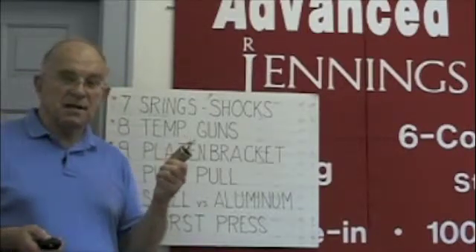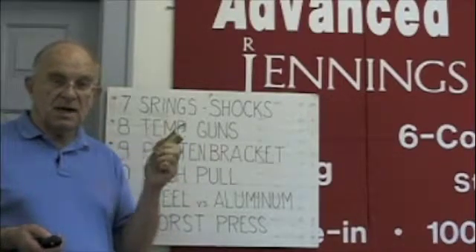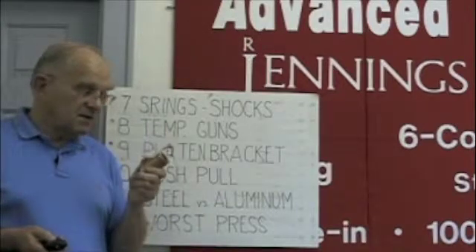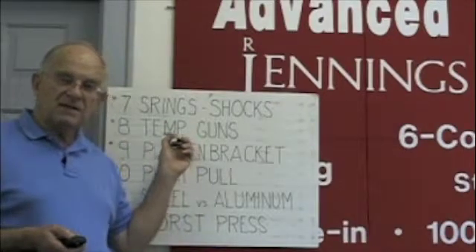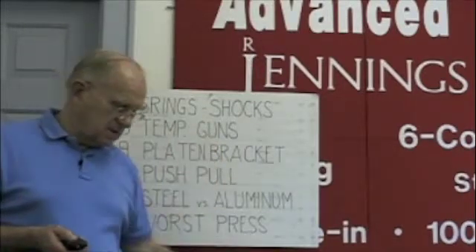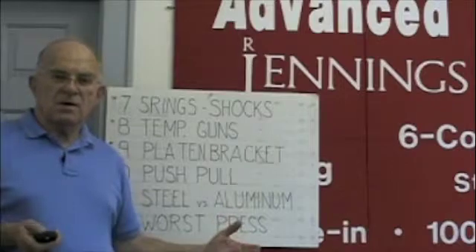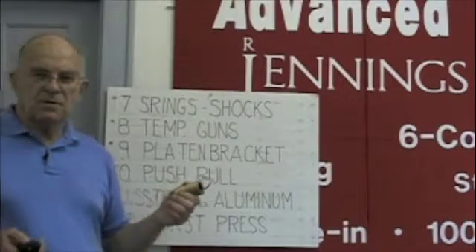When one of these springs breaks, it's like standing point-blank in front of a gun. If those pieces of steel hit you in the eye, it'll be in your brain — you'll probably be dead. And if it just hits you, it'll hurt like the dickens. Customers have told me a piece of steel went winging by their ear and put a half-inch dent in the sheetrock wall. It's absolutely dangerous. The companies that did that don't admit to it because they don't admit to the weakness in their press. So you don't want shocks, and you want to know whether you have music wire that's been heat-tempered or not.